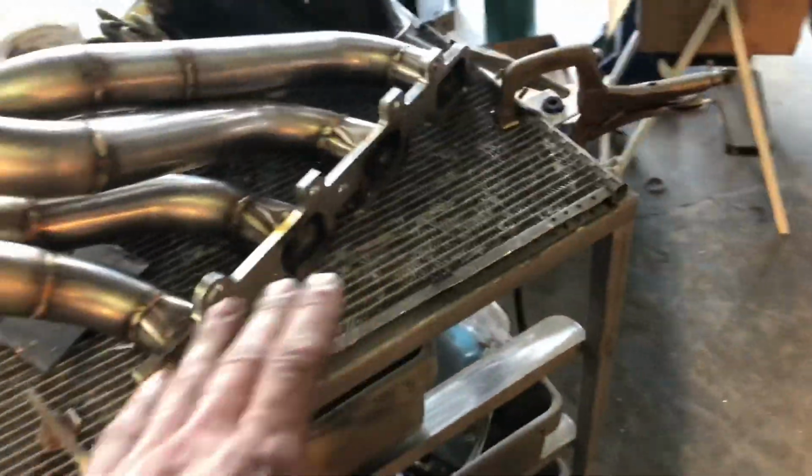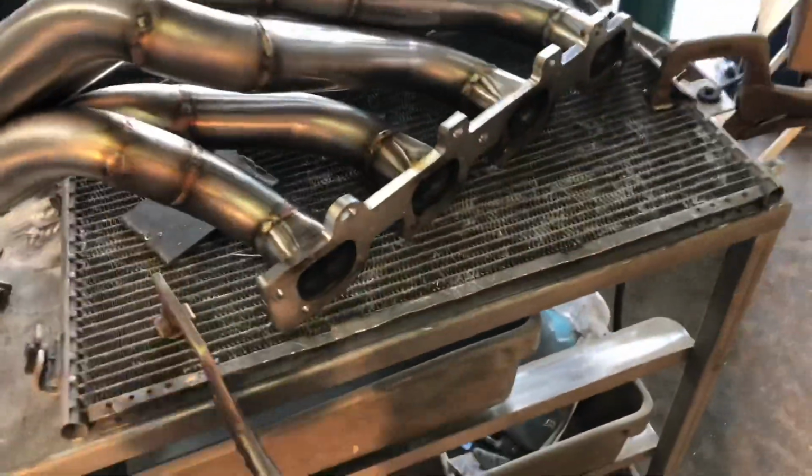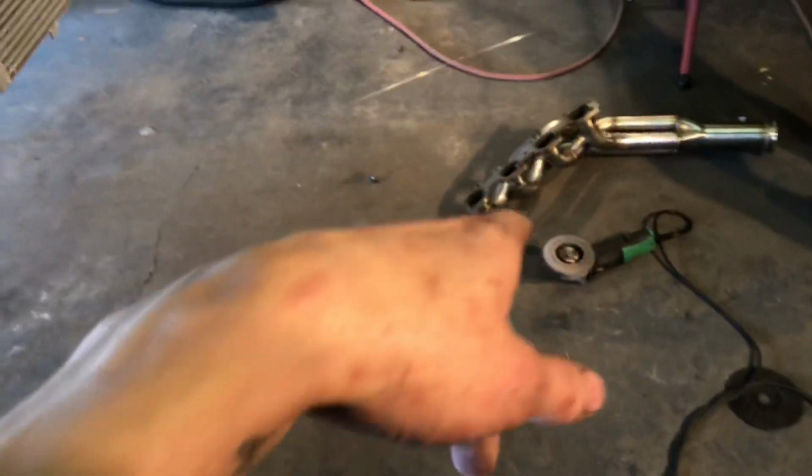Thanks for watching, guys. So everything is all welded up. Unfortunately, I did get a little bit of warpage here on this flange mostly, but also a little bit of warpage on that flange. And it's for two reasons. One is I didn't really have a solid surface to weld on. So even though it was clamped to this surface, this AC condenser and this table were probably both just buckling. And then also I was just hauling ass trying to weld as much as I can, as fast as I can, because I was in a time crunch. But they're gonna get that one decked down, probably maybe this one too while they're at it.